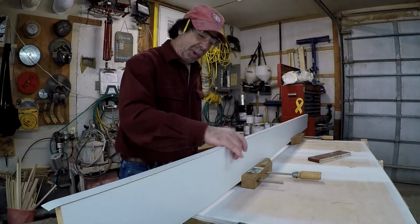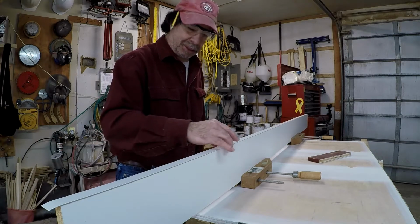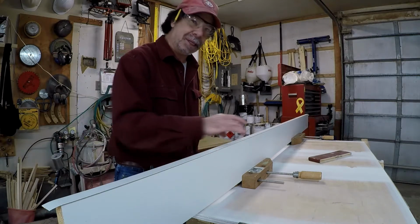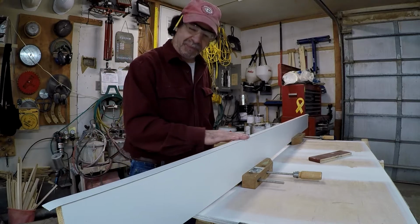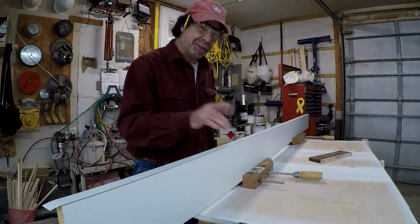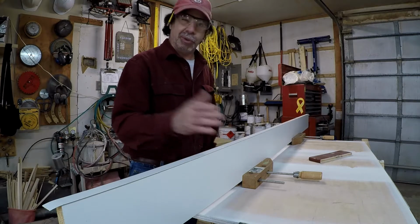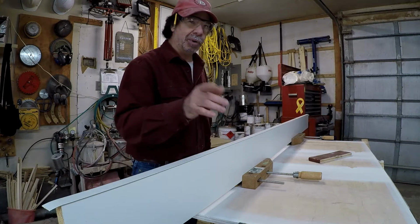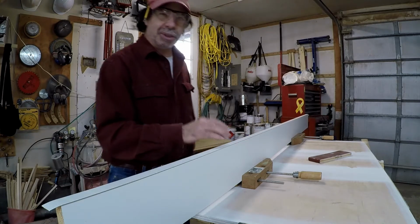So we're using a 3/4 inch board, and I usually use 13/16 edge banding tape, which gives you very little hanging over on each side. It's easier to trim. I ran out of 13/16. This is 15/16, so 1/16 under an inch wide edge banding tape, which you certainly can use. There's just a little more waste, so it takes you a little more effort to trim it down, but no big deal. So you'd want to use 13/16 tape.